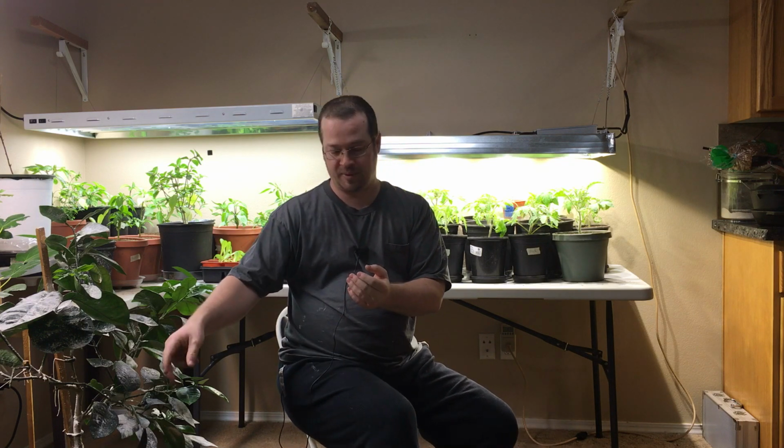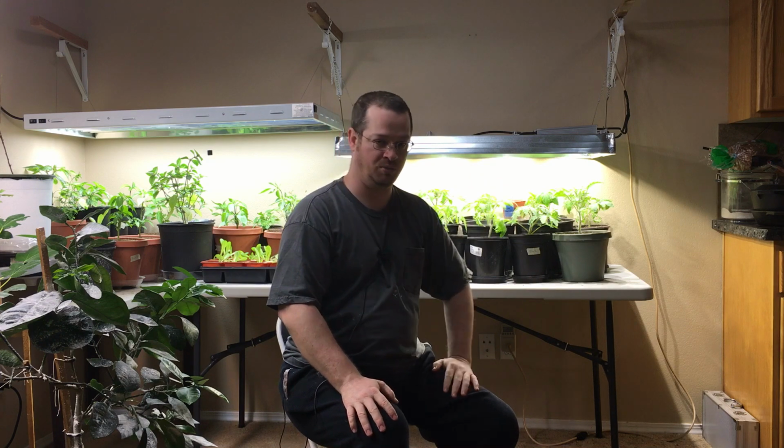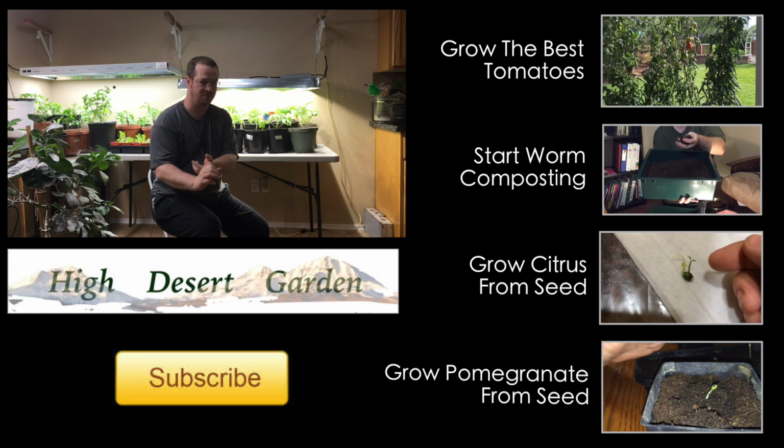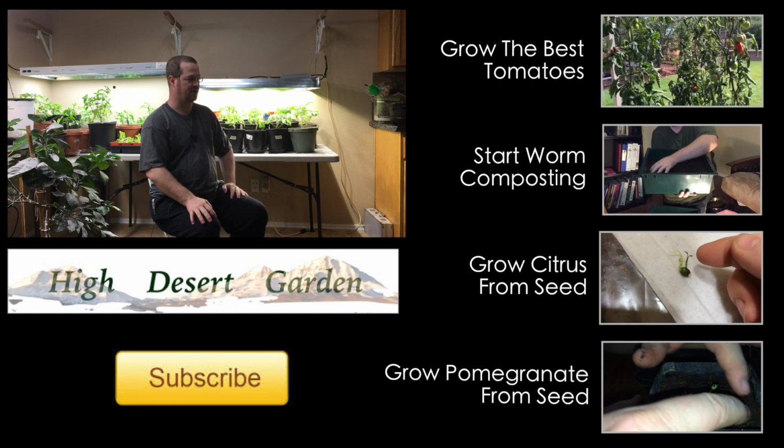Each plant, depending on what you're growing, might respond differently to different light spectrums. Not every plant is going to respond the same to 6500K. The pigment, the color of the plant leaf will actually change and determine what spectrum it responds best to. So that's something you have to consider when you're buying your LEDs and you're buying your parts for your light. What temperature you want to get, what light spectrum you're going to use. So it takes some planning and some thought to do it.